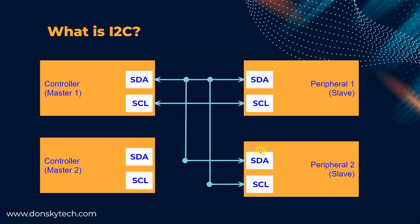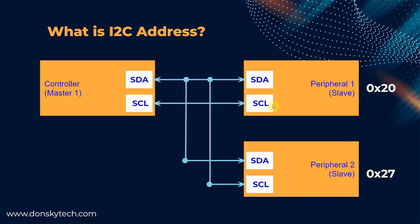The ability to connect multiple sensors on a single bus — which is the SDA and SCL combination of pins — makes it ideal for any Arduino-powered circuits, especially if you are controlling multiple sensors or components. Because of I2C's ability to connect multiple devices along its bus, the controller needs to know where to send the data. This is what an I2C address is all about — a distinct address ranging from 0 to 127 that uniquely identifies each sensor to your controller. Manufacturers of sensors and other I2C components have a default I2C address assigned for their sensors out of the box. The problem with I2C is that you cannot connect two sensors or devices with the same I2C address.